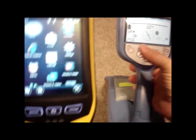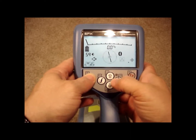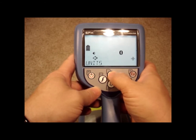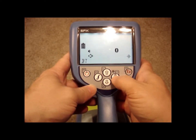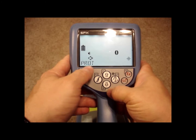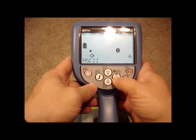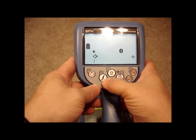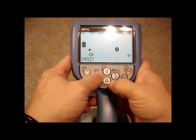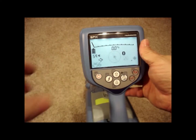Now I want to go into the locator and tell it what type of language I want it to export to the GPS. I'm going to go back into the menu system by pushing the on/off key, scroll until I get to Bluetooth again, go into that by hitting the peak/null button, and scroll until I get to protocol — P-R-O-T, protocol. I'll go into that and select the ASCII option, select number 2. We want mode 2 ASCII protocol. Hit the frequency key until I'm back to the regular screen. We're all set on the locator and don't need to do anything more there.